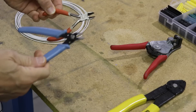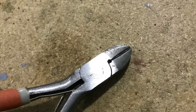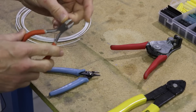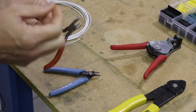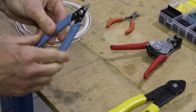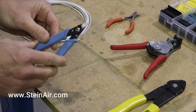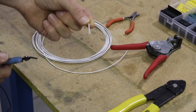What's the difference between these two? On a regular pair of dikes you can see that the edge is beveled where it cuts. It can still cut wire, but you'll find that if you cut zip ties with this — and believe me you'll be cutting a million of them with the wiring job — it still leaves a little bit of that zip tie sticking up that can scratch your hand. With a proper pair of wire cutters, the back is perfectly flat and they're also very sharp, so they do a great job of snipping off wire.